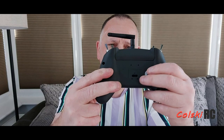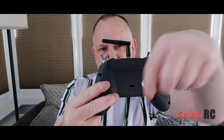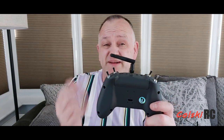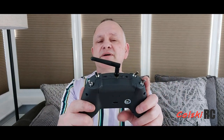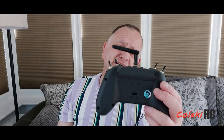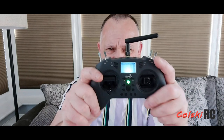This one has a module bay on the back so you can attach modules. You can put Crossfire on it, but the issue is that Crossfire uses too much voltage. So it will not perform very well with this battery unless you're running Crossfire on 25 milliwatt, in which case you're not really gaining much. You can set some different preferences in Crossfire to make it a little bit better, or buy the best quality battery you can and have a few flights before it goes dead. All in all I like the texture — it's got a rubberized coating, though that will come off. I've already started to wear out the writing on it and I've hardly used it much.